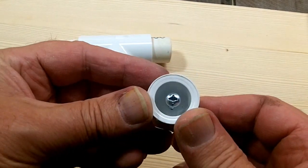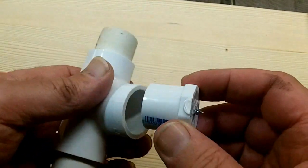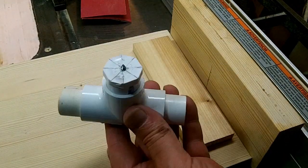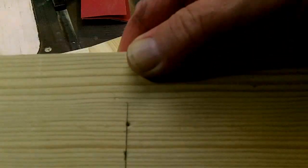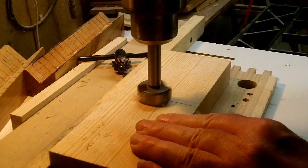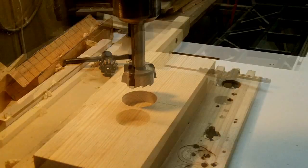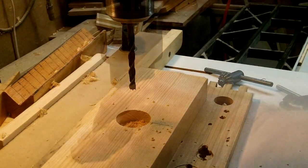To mark the holes where to drill the water bar, I took a little 3/4 inch plug and put a number six screw through the center of it — that allows me to mark where to drill the holes. I want the water bar to sit just above the mat slightly, so I put a block of wood under there to give about the right spacing, then push hard to get a mark for drilling. I like to drill about halfway through for the tee, then drill the rest of the way through with a drill the same size as the 3/4 inch pipe coming in from the back — that way you get a nice snug fit on both.